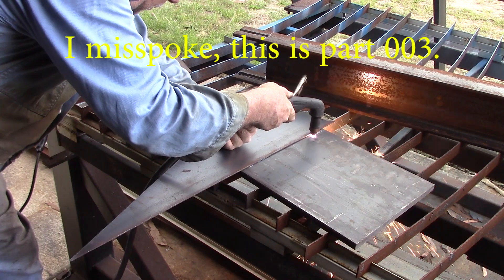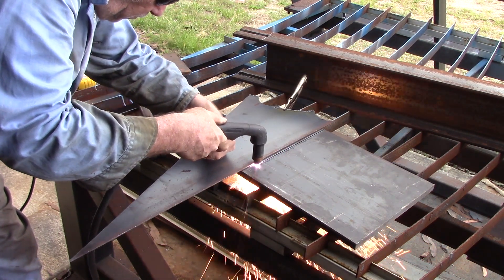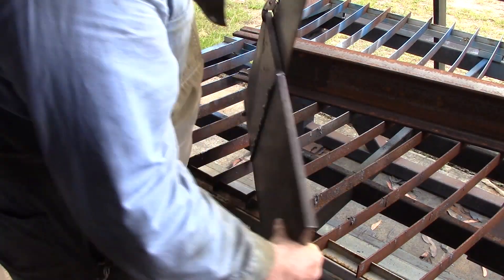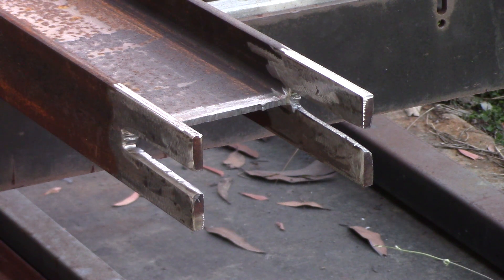Now the next thing I want to do is cut part 002, which is the slider plate, and I don't have anything the right size for it, but I do have material that's the right thickness and considerably larger than I need. So I'm using a strap of 4mm sheet with a straight edge as a guide to plasma cut to the size that I need. I've ground all around the cutouts on both ends of this I-beam. Now normally for most jobs that are non-critical, I'm happy enough with stick welding to burn through the mill scale, but in this particular case it's going to be under heavy load — this is going to be at least a 20-tonne splitter. I wanted to make extra certain that the welds aren't going to let go, so I've ground through all the mill scale and the rust down to clean metal, and I'll do the same on the pieces that I weld so that we're biting into clean metal with no contaminants. I'll use probably 7024 or 7018 to do the welds.